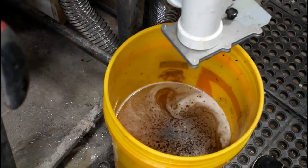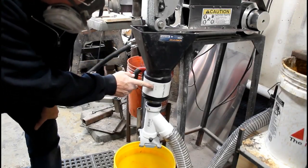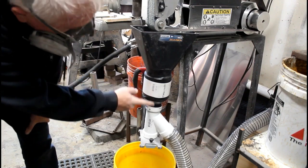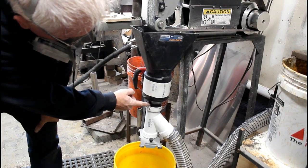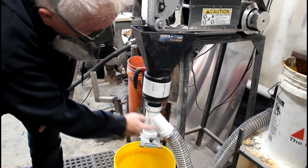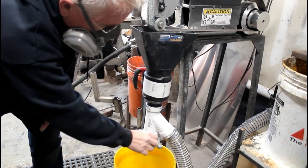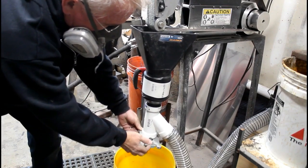This system is fairly easy to make. It starts with a four-inch dust collecting hood — you can find that on Amazon. I've got a piece of four-inch PVC that connects to a four-inch to two-inch reducer; those are both dust collecting system components. Then I went to a two-inch PVC Y-connection. One part of that is connected to a flexible hose that goes to my wet/dry vac, and the other side goes to an aluminum blast gate.